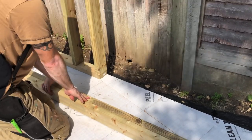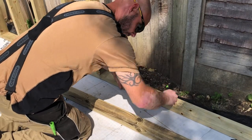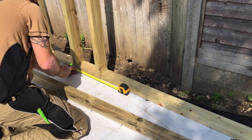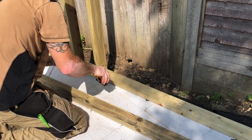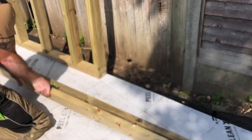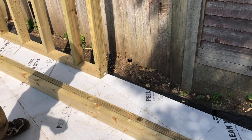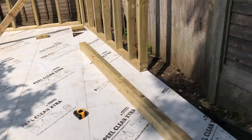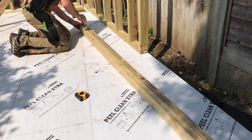I've got my head, I've got my base. What I'm going to do is temporarily just stick that down there like so. I will then measure from the centre of that stud, which is over here now, mark off my 400 there, transfer that to the side like so, bring that over here, and now if I bring the camera around a little bit, I now know where my 400 is, or where that mark is.